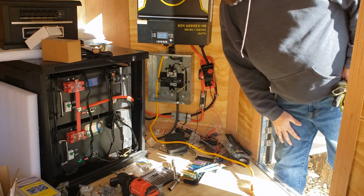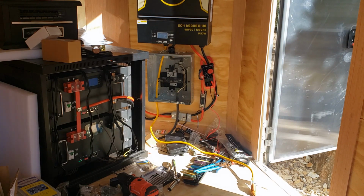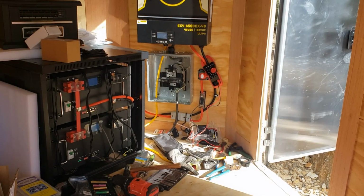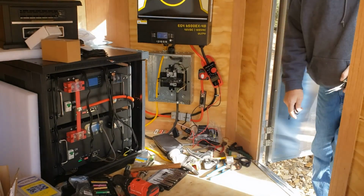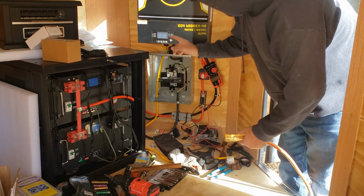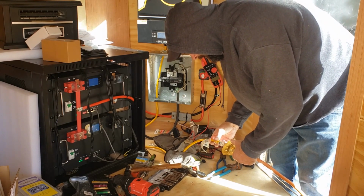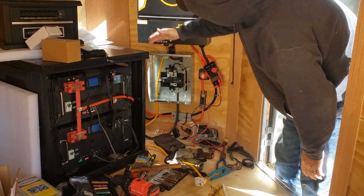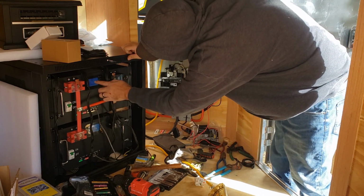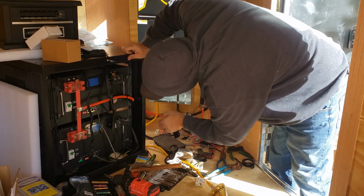There it goes. Both batteries are at 2 amps in, 4 amps, 5.5. I got it set only for a 10 amp charge. So 5.2 amps and 4.39 amps going in. So we'll let these charge up and then we're going to test the system on the well with a split phase adapter transformer. It's a SolarEdge autoformer. And we'll see, without solar, with these batteries fully charged, how long it can run the well.